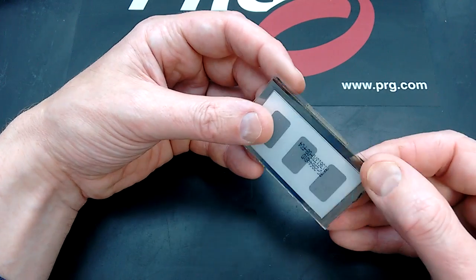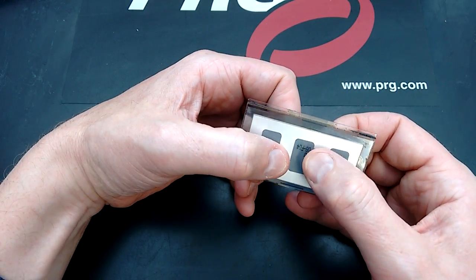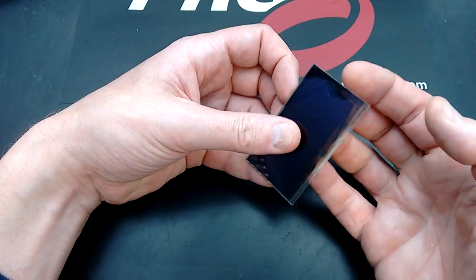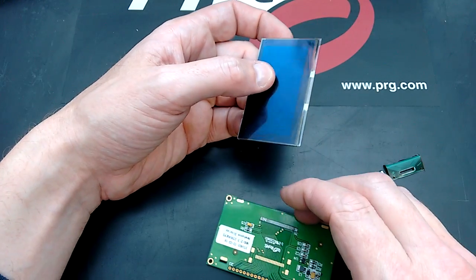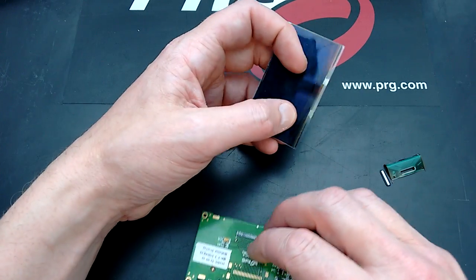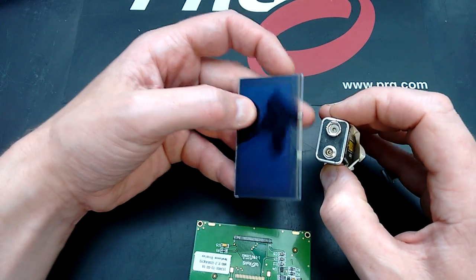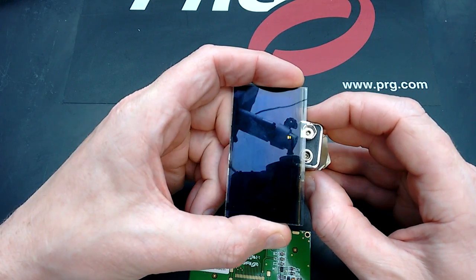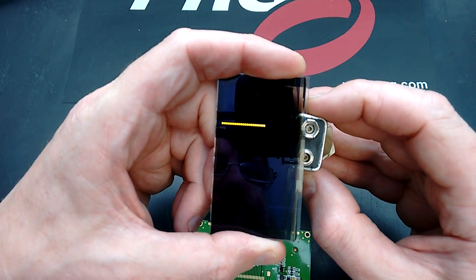The display itself — I tried separating it, but it does seem to be vacuum bonded together. It's got a series of electrodes on top and a series of electrodes on the back that sandwiches the electroluminescent film. And if you actually run a battery across the back of it — and this isn't recommended, this isn't the correct way to drive OLED by any stretch of the imagination — you can actually get the rows of LEDs to light.